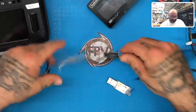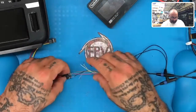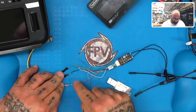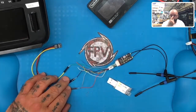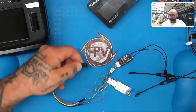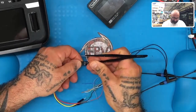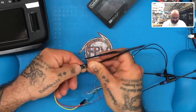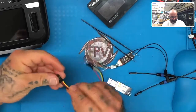Let me make it very clear: the positive and ground on the back of the RadioMaster radio are in reverse order. So we have to switch the positive and ground on the cable because it won't work otherwise. Positive is actually going to be the first one. If I didn't want to de-solder it, I could just pull the tabs and swap the wires — I'll show you what it should look like if you're going to plug it into the back of the radio.